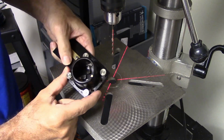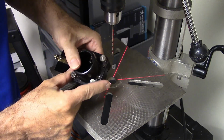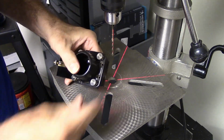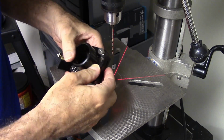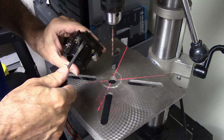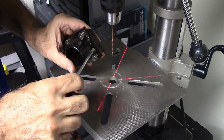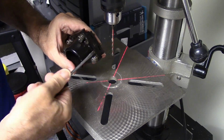Here I'm re-drilling the holes in the tube socket holder, since this tube socket's a little bit bigger than the one I've replaced. I'm also going to follow up with a threading die to rethread the holes. The screws go directly into the hard rubber.